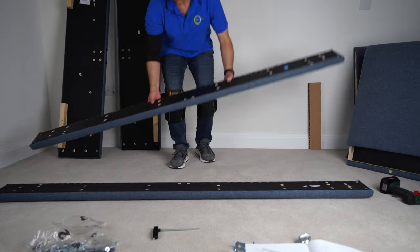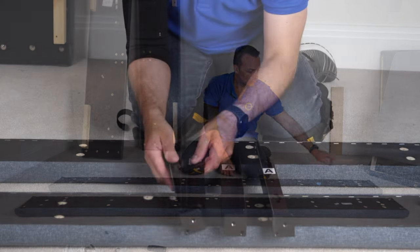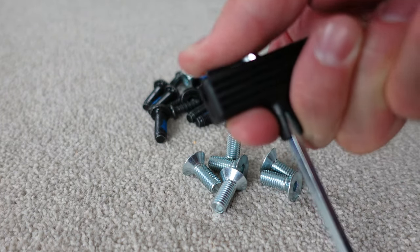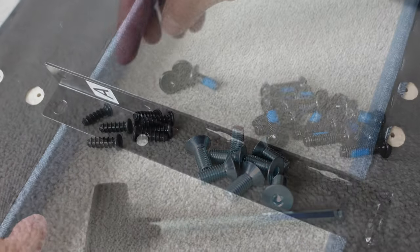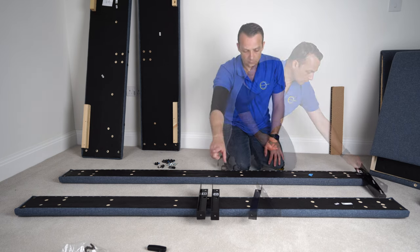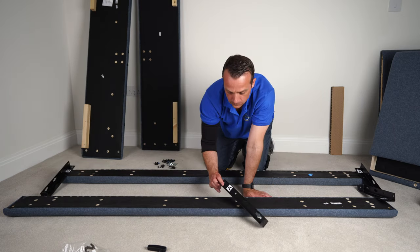Prepare those panels exactly as shown — these are going to be the side panels. Here you have three holes on this side and two holes on this side, with two holes in the middle. We're going to need brackets B and A from bag number one — open it up. Organize the screws. One side of the bracket is open and one side is closed. The closest bottom is open, the top is closed. Position bracket A on this side first, then B against it with the closed parts at the bottom and open parts on the top. Another B on this side — that's why I say position the panels exactly as I have it so you have an easy time.